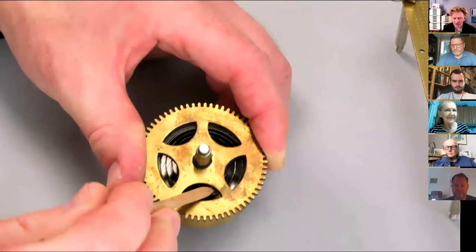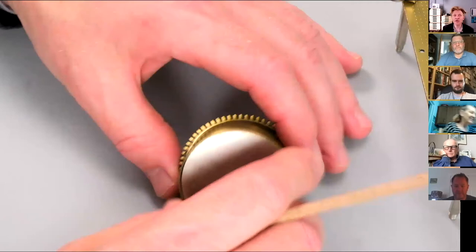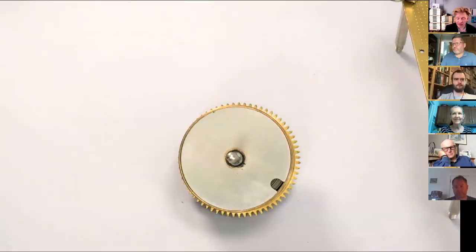And the problem with the mainspring is that you really need, and we're going to talk about tools a lot next week, if you want to get the spring out of that barrel, then again, opinions vary, but you need specialist tools to do it. So what we would say for the beginner is that we make reasonable adjustments so you can clean the clock and leave the spring in the barrel. Maybe not regarded by some as good practice, or certainly not best practice for a professional repairer. However, for the beginner, as a confidence building exercise, we're going to leave the spring in the barrel. But that's not our problem today.